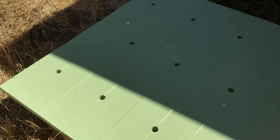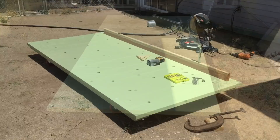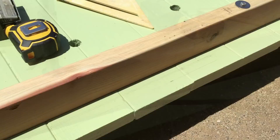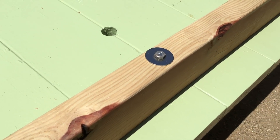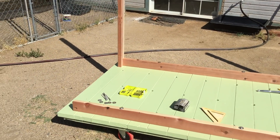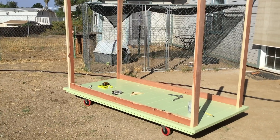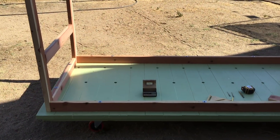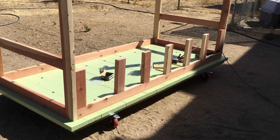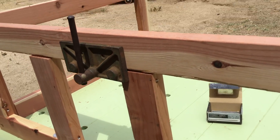The base is done. Now we begin the framing, building a frame on top of the base using stainless bolts and washers to secure it down. Starting to look like something now. For the frame, we're using 2x4 redwood — you can also get that at Home Depot. Now we're framing the lower walls. By the way, this clamp came in super handy to secure everything tight before screwing in the stainless deck screws.